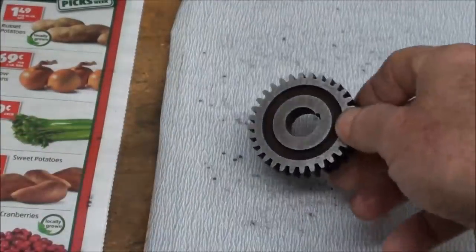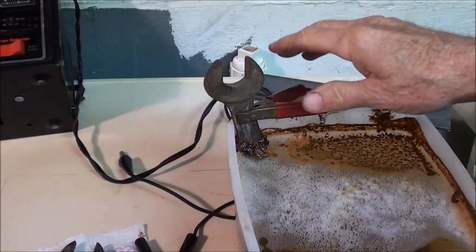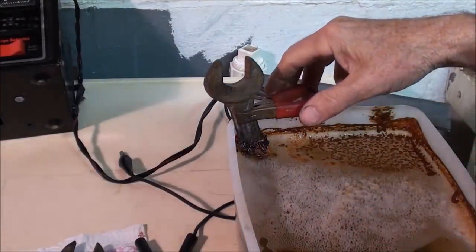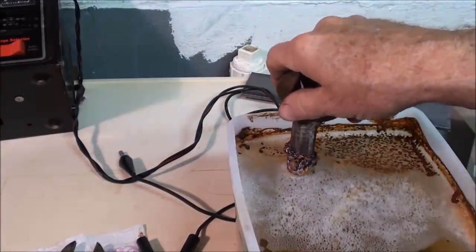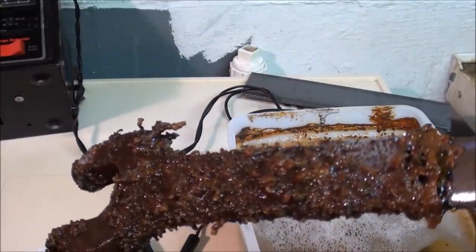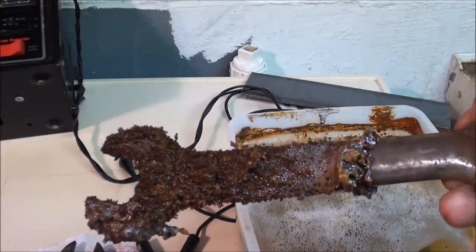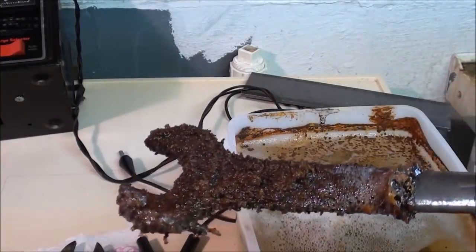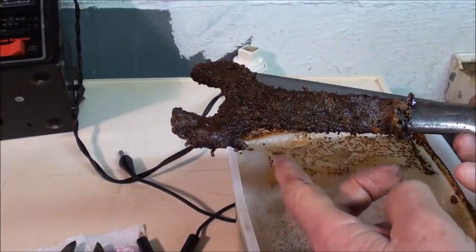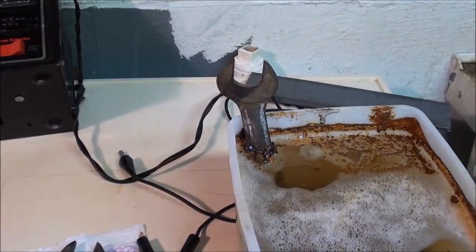I've got to do that to the rest of them, but in the meantime I'm going to start another project. Let's take a look at our anode. By the way, the work was the cathode, and remember that direct current electricity always flows from the negative to the positive, and you cannot use AC. If you don't have a battery charger, you cannot use just regular household current. Look at that — 24 hours. It kind of reminds me of barnacles, the way they build up on a piling down in the Gulf of Mexico. It's kind of nasty and it's hard — it doesn't just scrape right off. Don't throw that down the sewer — the EPA will get mad at you.